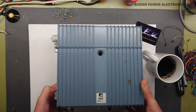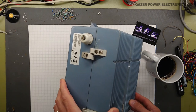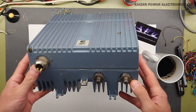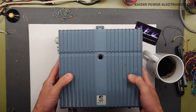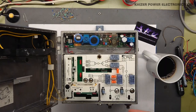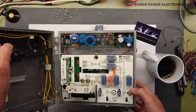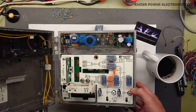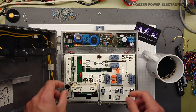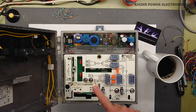The optical node has a 24 volt to 65 volt AC input, fiber connections, and two outputs. It's secured with a single large bolt. As it opens up, we can see the fiber cassette sitting over here, where the incoming fiber connects over to two internal fibers, which go to an optical receiver module and a reverse transmitter module. We'll get these out later and take a closer look.